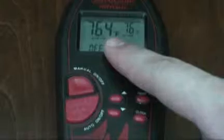All three models will display the room temperature, but only the Advantage Plus and modulating remotes will allow the set temperature to be changed. To do this, press the auto on-off button, then adjust the set temperature in accordance with your comfort level using the up and down arrow keys on the handheld.